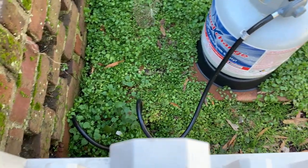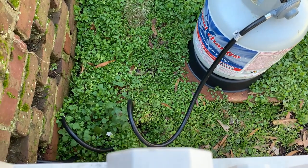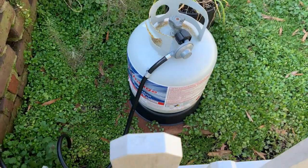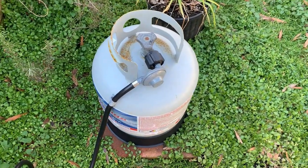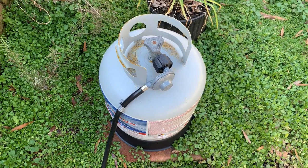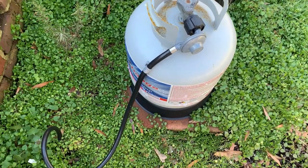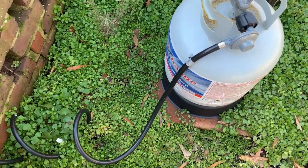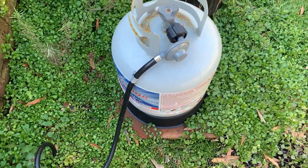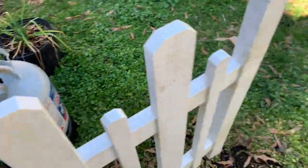...I gotta spend money to replace that hose. Medium scenario, there might be a little bit of gas in that hose and give me a nice pop. And then worst case scenario - I treat stuff like this like a gun. That valve is closed, but I'm assuming something's not right with that valve. If it's got a little bitty leak and it's filled that line up, I nick that thing with an electric motor running - worst case scenario, blow that tank up when I'm standing there three feet away.